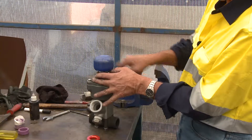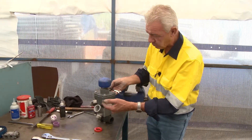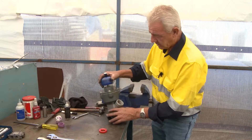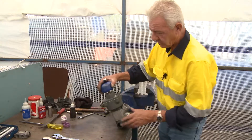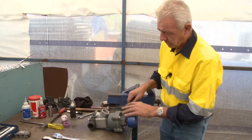Remember: the air line that goes down from the auto valve to this valve — I've taken it off, opened the dead man, the air's coming to this, so something is wrong with this. The biggest problem with these is moisture — they don't like moisture. So if you're getting excessive moisture, you need to install an air prep to diminish the amount of fluid that runs through this.